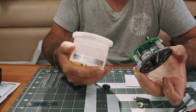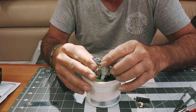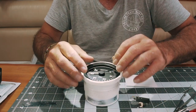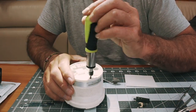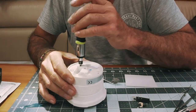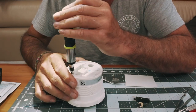From here, reassemble the unit — put the guts of the dial and instrument back into its case, aligning correctly. Apply the bezel, the lens, and push the retaining screws into place at the back. Once that is done, it is simply a question of taking the dial, reinserting it into the engine panel, and making sure that everything works correctly. Let's have a look and see if we've got our engine hours back.